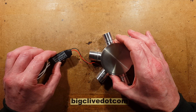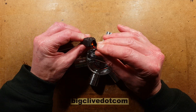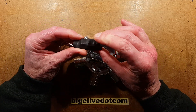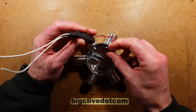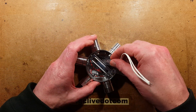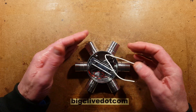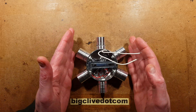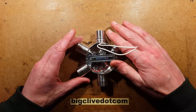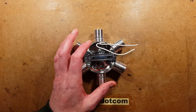The first thing worthy of note is that the power supply, to save space, doesn't have a little box. It's just a heat-shrink sleeved power supply stuffed in underneath. It's the typical power supply - a current-regulated supply that puts out a current-limited supply at whatever voltage the combined LEDs in series require. These LEDs are presumably all connected in series - we'll find out in a moment.